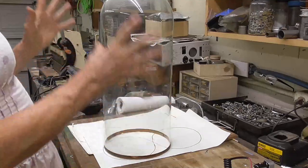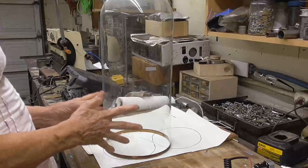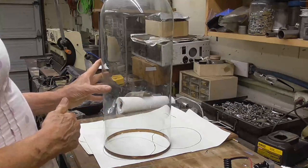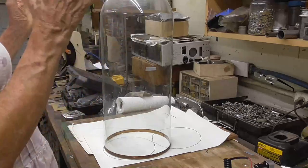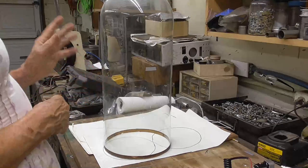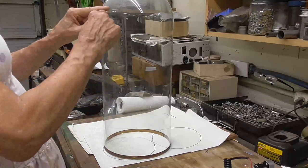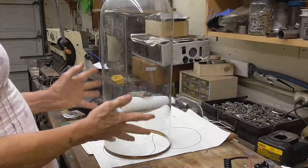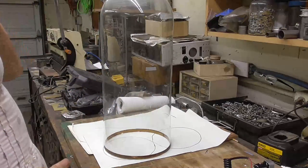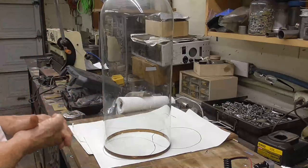We cannot have the conventional design of Nixie with the whole envelope filled with neon under a vacuum. There are a couple of different problems doing that. Even if we had an envelope that would take the pressure, the problem comes from electrical problems. When you've got huge distances between the parts of the number and the anode, there's all kinds of problems that crop up.